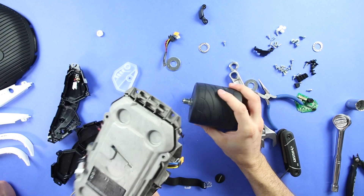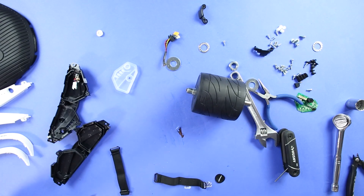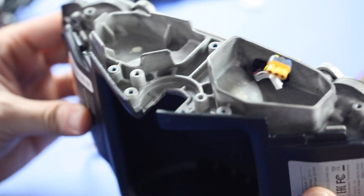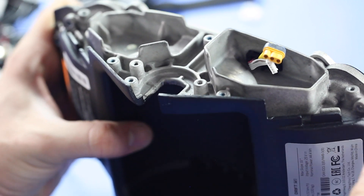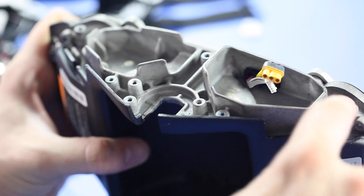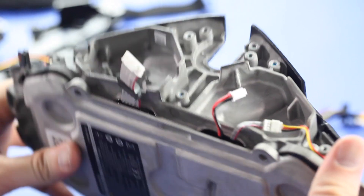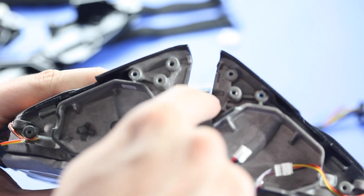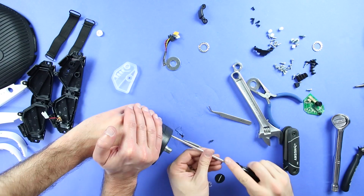So the rest of this is just chassis — wow, that's light. It really was just — most of the weight is the motor. So this is a very interesting piece of cast magnesium. The only post-cast machining operations they did was drilling and tapping these holes in three orientations in a milling machine. They did not even have to resurface or align the axle seat and yoke. So they kept the magnesium machining operations, which can get expensive and possibly dangerous, to a minimum.